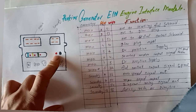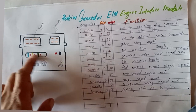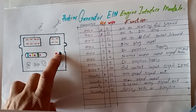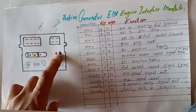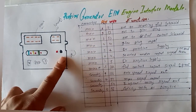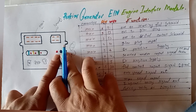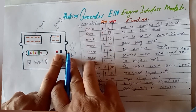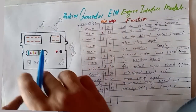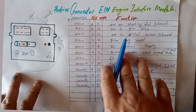The last indicator is the overspeed light. If this light is blinking, it means the engine is not synchronized with the controller. To synchronize: remove the rubber cap, insert a small flat-head screwdriver, and rotate clockwise until it stops. Then start the engine and rotate counterclockwise until the light goes off — stop there. This means the controller is now synchronized with your generator.